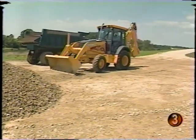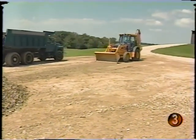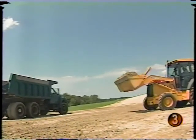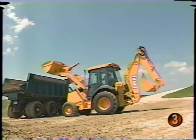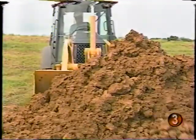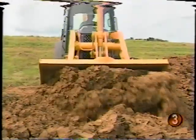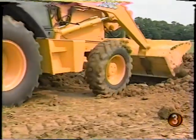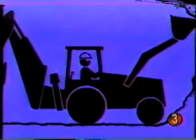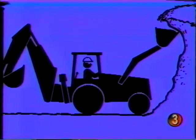When using the loader, keep the loading surface smooth and level. This not only makes it easier to load the truck, but it also avoids the possibility of tip-over when the loader is being raised to dump. To prevent cave-ins near an excavation, work perpendicular to it or at a slight angle — this will keep extra weight away from the edge and limit cave-ins. Be especially careful to stay away from undercut embankments, as this can be hazardous to machines and operators either above or below.